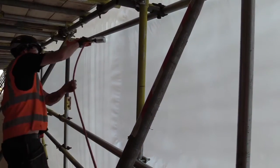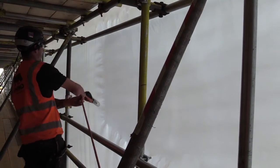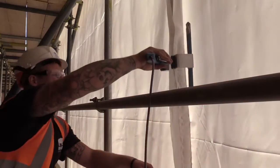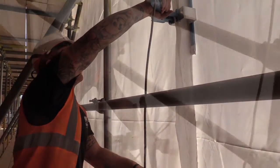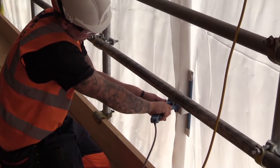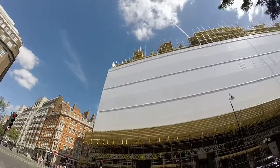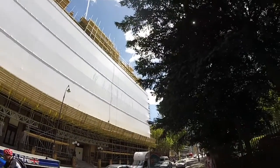In its basic form, scaffold shrink wrap is an LDPE polythene film that has two really important characteristics. Number one, it's designed to shrink really powerfully, so when you put it around the scaffolding and you heat shrink it, it's going to fit really, really tightly, and that's what makes it so strong and robust. The second feature is that it can be joined and heat welded to other sheets really easily, meaning there's no limit to the size or shape of the scaffold structure you might want to wrap, and it enables you to create really effective containment — a continuously bonded skin around the entire scaffolding.